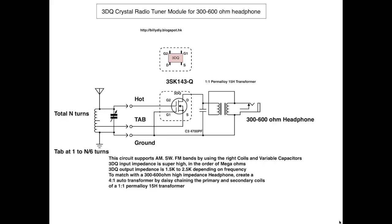This is the circuit diagram. Starting from the left-hand side, you have a coil and a variable capacitor — it could be for AM, shortwave, or FM. You can connect that to three different points: the hot, the top of the coil; the tap, the divided outlet of the coil that connects to the detector; and the ground, which is also called the cold end, which is the bottom of the coil.